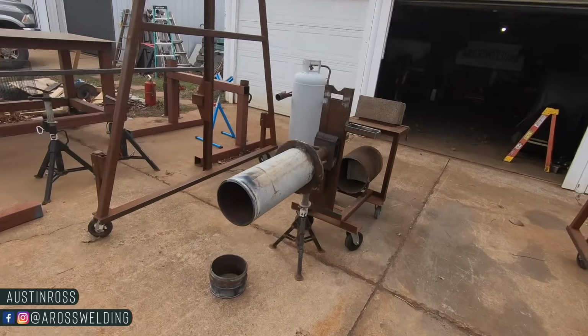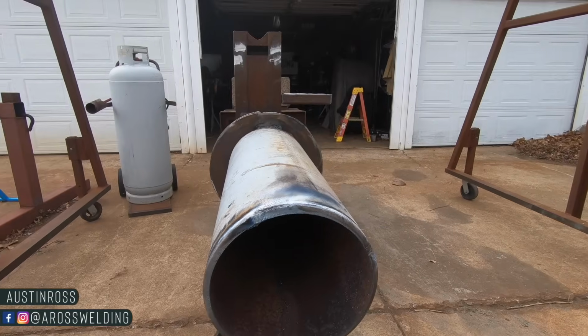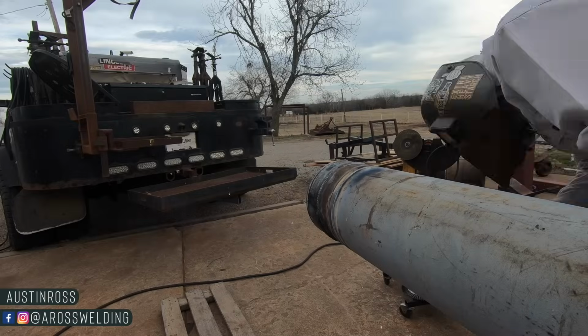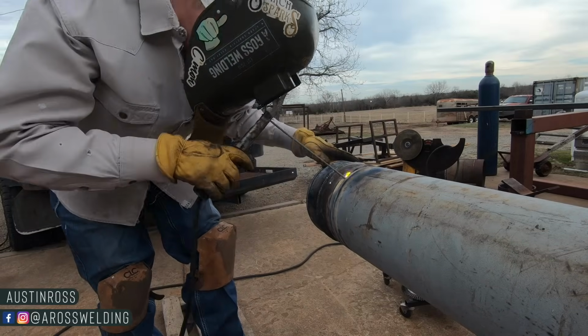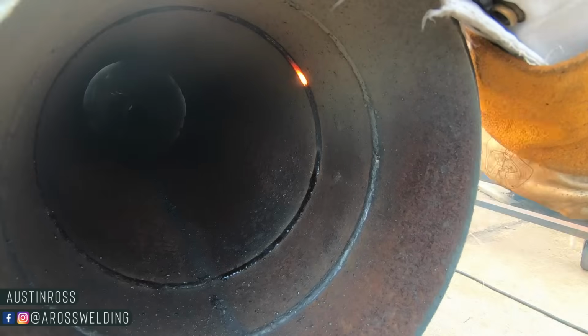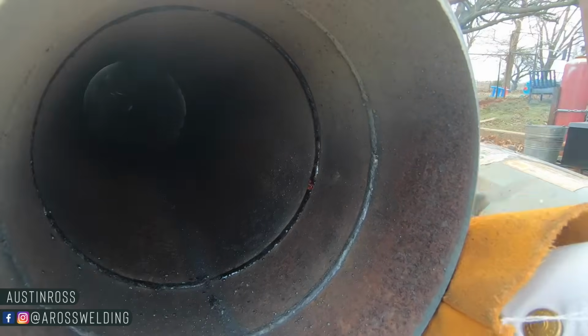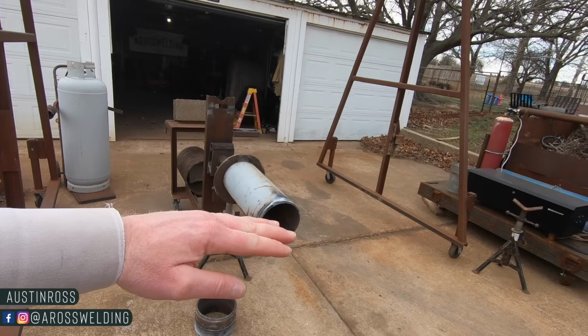Today we're gonna make an 8-inch weld, just under 375 wall. I think I'm gonna do a downhill bead, downhill hot pass. 6010 bead for the root, 1/8 6010, and 5/32 8010 hot pass. And then I'm gonna fill and cap with 3/32 7018. As far as the position, we're just gonna do it flat.